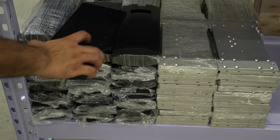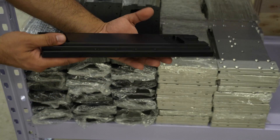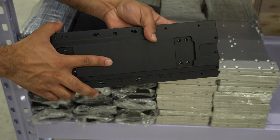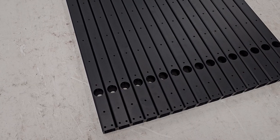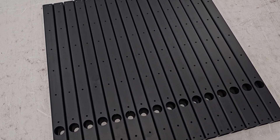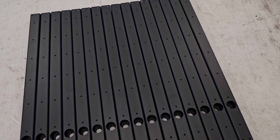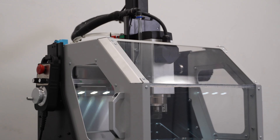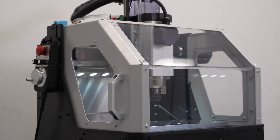To address the metal quality concerns, we have a new manufacturer that paints our metal exceptionally well, making sure everything is free of burrs and dust beforehand. On top of that, we are now facing down all of the square tubing on both sides of the rail surfaces to ensure the rails mount perpendicular and flat to the frame. This drastically improves the fit and finish of all of our metal, taking us to a whole new level of quality we never had before.